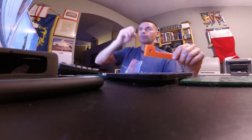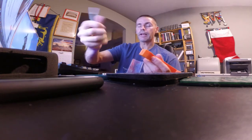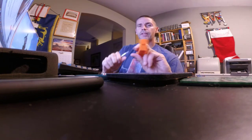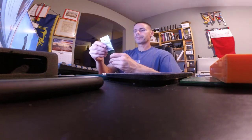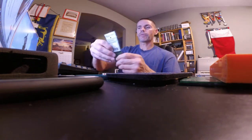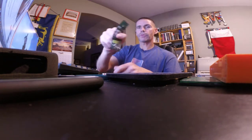What happens is when you insert the nuts that he has listed, unless you jam a flat-end screwdriver in there, when you go to tighten it, it wants to spin. With these larger washers it's a very snug fit — so snug that I have to get it started and then use pliers to press it into place. Once it's pressed in, I take my needle nose and stick it inside the center of the nut and slide it until it's lined up dead center in the hole. Then you're ready to screw it together — I use quarter-inch, 20-thread, inch-and-a-quarter machine screws, and these fit the nuts perfectly. Once you tighten these up it really snugs everything up nicely.